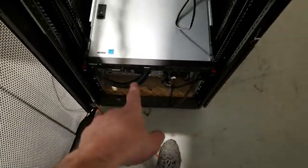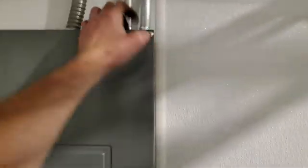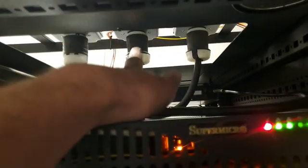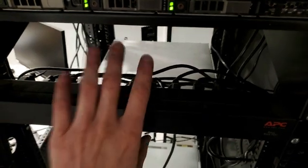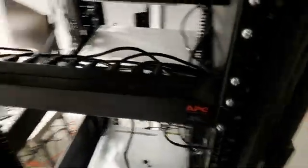So what I'm going to do is actually remove one of those batteries out of service temporarily. I'm going to pipe in a conduit back to here and take that over to our panel, and through it I'm going to run four number-10 wires and two number-12 wires. I'm going to take our line power out of here, send it over, come back out of that system, come back over and connect it to my 120-volt — basically replace one of these line-power 30-amp circuits with an actual battery circuit. Then I'm going to come out of that to one really big 30-amp PDU.